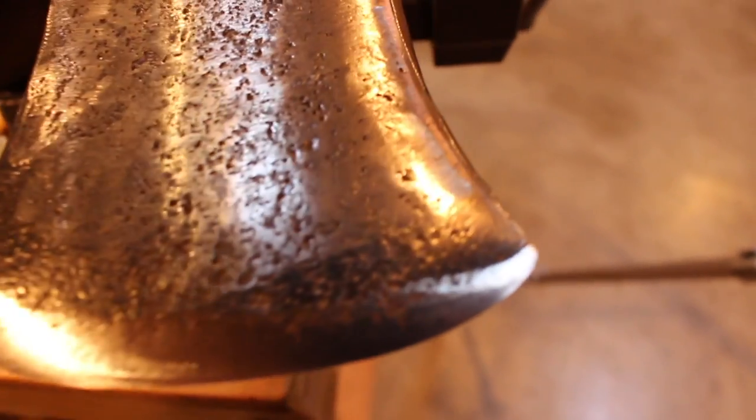Let me show you what we got here. You can see there are some little striations in the metal from the file — that's fine, we're going to get rid of those in the next phase. We've basically gotten rid of most of the pock marks and it's got a nice smooth edge with no chips. At this stage the blade is wickedly sharp so you've got to be really careful. We could put it on a handle and cut wood with it right now, but the blade would dull very quickly.